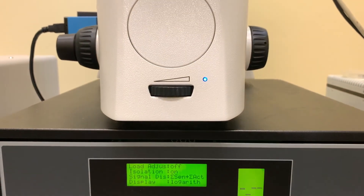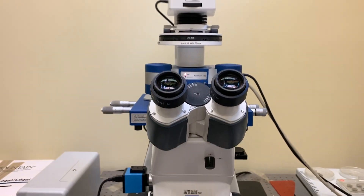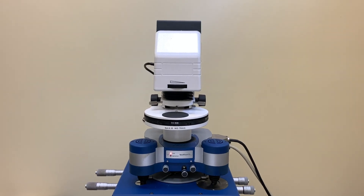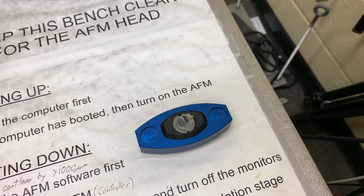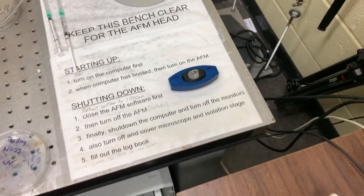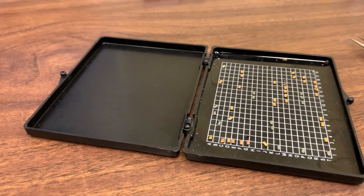Above the platform is an inverted microscope that is the base for the AFM. The microscope allows the user to view the surface and pick specific positions on a sample to measure the surface topography. It is also essential in aligning the laser and AFM probe cantilever. This is the AFM probe holder, which is inserted directly into the AFM itself. It has a strip of clear glass where the laser is able to shine through and strike the cantilever. Here are some typical AFM probes — the bronze colored contain contact mode tips, and the silver contain tapping mode tips.